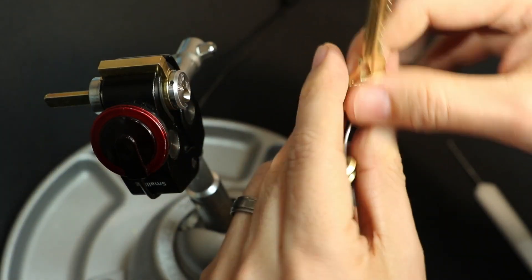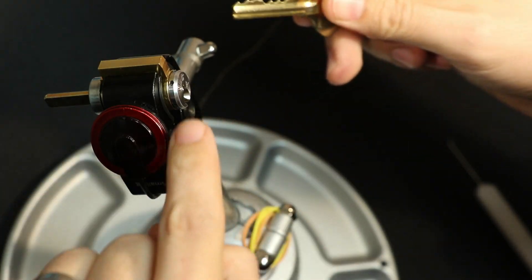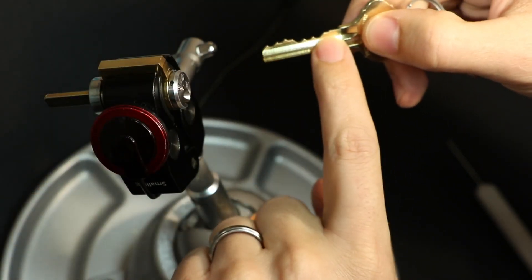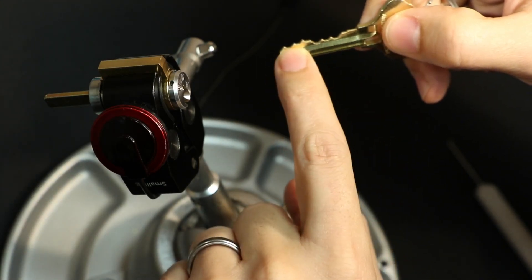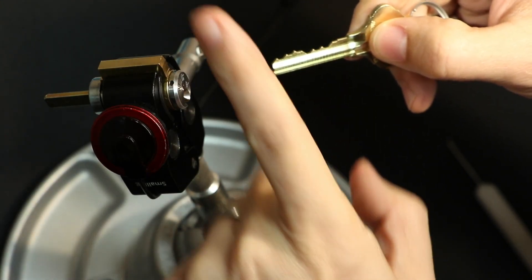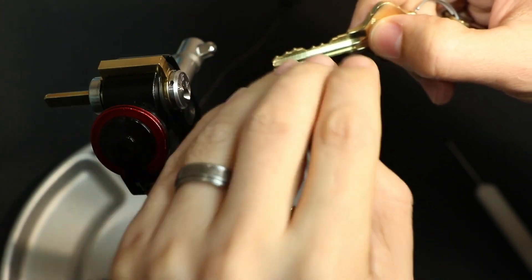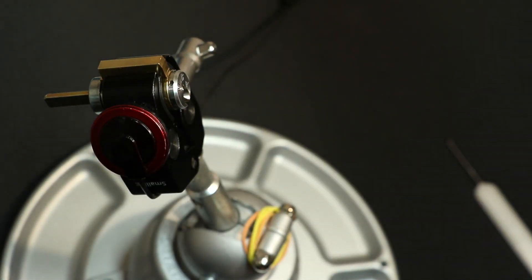On the other side, unlike a normal Primus, this one has — instead of top pins — another sidebar on the left. So the SL sidebar here has seven pins. And while the Primus has standard pins, this one has pins that have serrations in them that act like false gates.